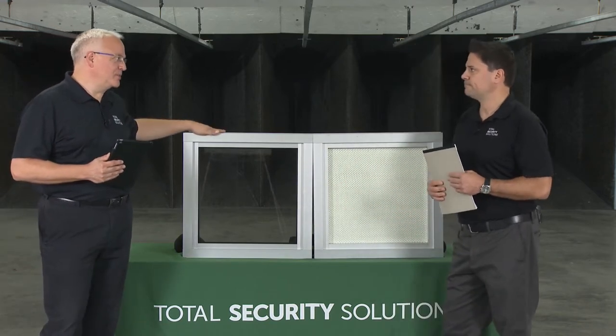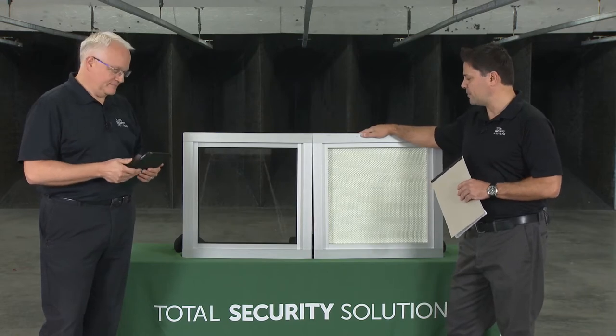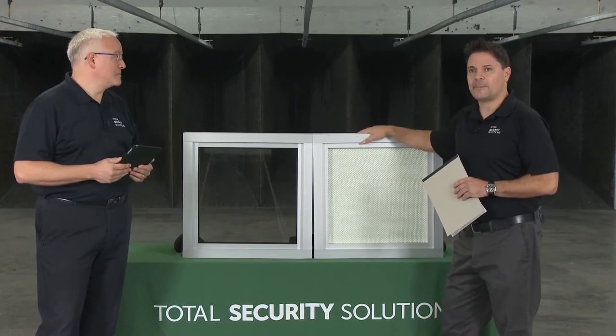It's all encapsulated here with the Level 3 framing system, our BL 1.75, which is an inch and three-quarter by four inch tube with a two-piece channel system holding the glazing and the fiberglass together. And this is an aluminum framing system, which comes with different finish options as well.